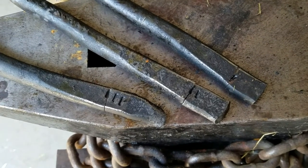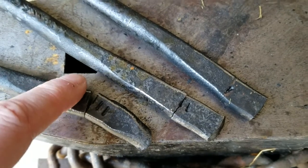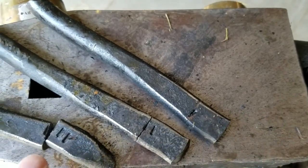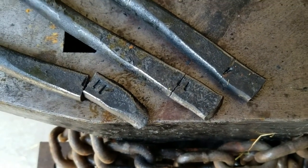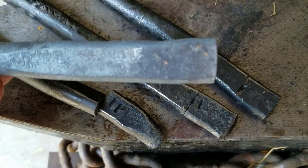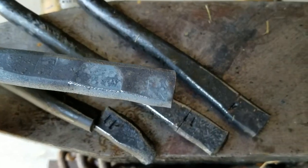Adding on to the previous video where I hit these with a hammer and cracked them to potentially prove hardness — every single one of them broke where I'd stamped them. The stamp was made when the metal was hot. The control piece, which was unquenched, didn't break, but it was number zero and didn't have a stamp. So I wonder if that made any difference. What I'll try and do today is not stamp them in a critical spot.